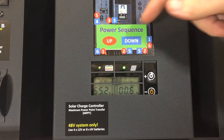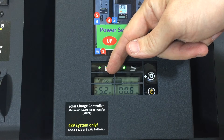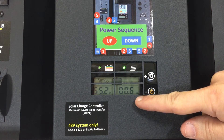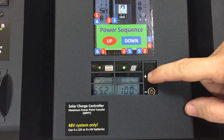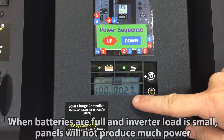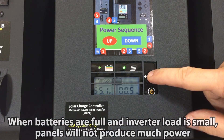This is the home display. We can see that the batteries are connected, that the solar panels are producing power, and that the solar panels are charging the batteries. The battery voltage is at 55.2 volts and the current going into the batteries is 0.6 amps. Pressing the button shows the batteries are at 100% charge. Pressing again shows the voltage at the solar panels and how many watts they're producing — in this case 27 watts at 100 volts. This needs to be below 150 volts. Pressing again takes us back to the home screen.